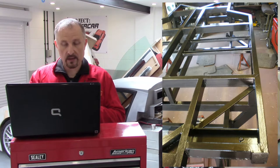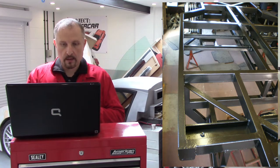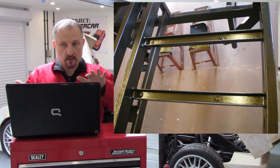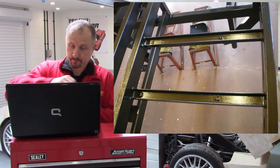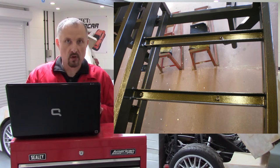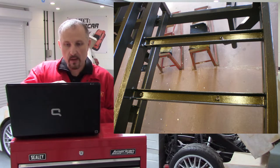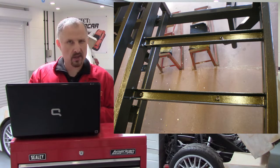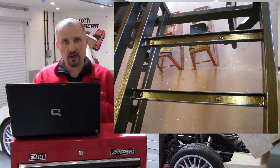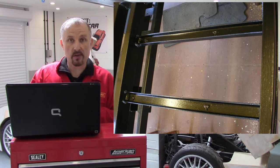This is the left side of the chassis. These bars are to support the seats — they're obviously upside down in this image. I've always wanted the seats in this car to be bolted to the chassis so it's super strong, so there's no vibration and no cracking in the gel coat. This is why I put some steel bars in the chassis to bolt the seats to. You might notice the captive nuts — I think that's a requirement in some countries. I'm pretty sure it is in the UK: your seats have to be held in with captive nuts. And here's another image of a set of bars for the other side.